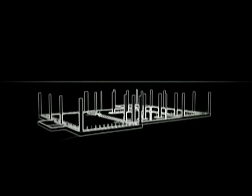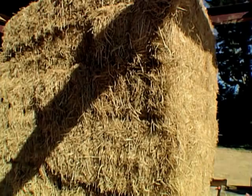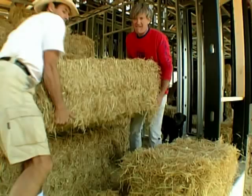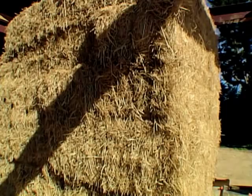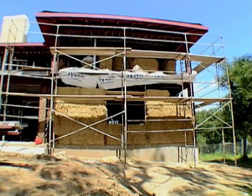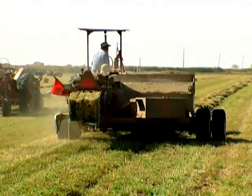Previously on Building Green, we put up the steel post and beam structure for earthquake sturdiness and covered the building with a metal roof to keep our straw bales dry during construction. We then infilled all the exterior walls with straw bales. Those bales are made of rice stems and will act as structure and insulation in one. Not only will these bales keep the house well insulated, they will create a beauty and feeling like no other wall system does. In the end, our walls will be close to 30 inches thick and create a cozy contained feeling.